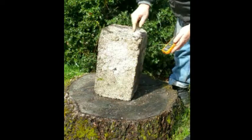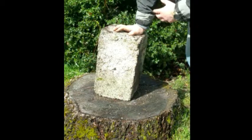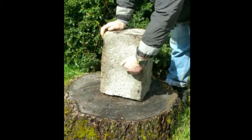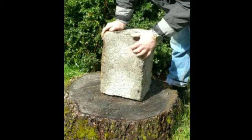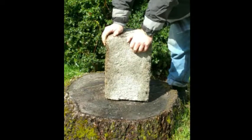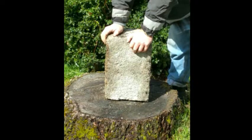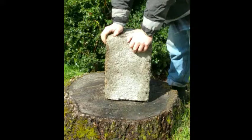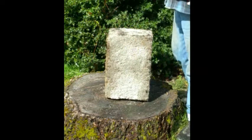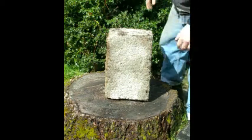And mind you, the cavity in this block is halfway in, so we were, in essence, testing a block that was 5 inches thick, because it's 10 inches across, but we were measuring 5 inches in. All indications are that if people use this composite, it's going to be closer to 6 to 8 inches. So the heat transfer is going to take even longer. The building or barracks or shed or house is going to last even longer in a catastrophic event.